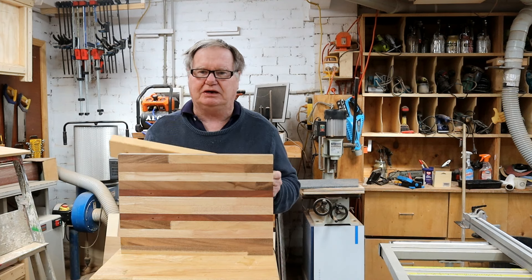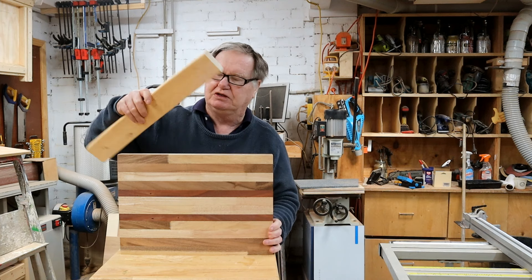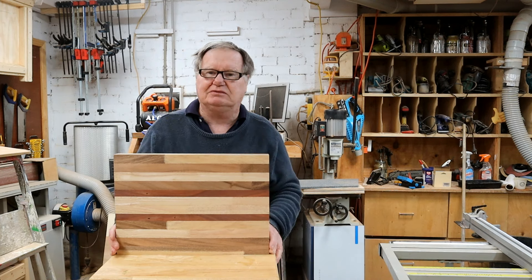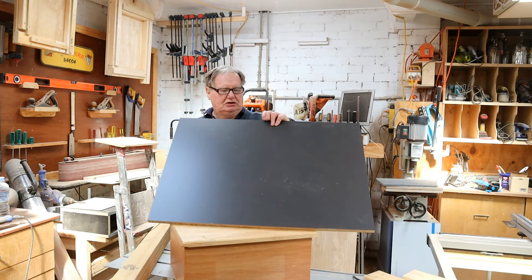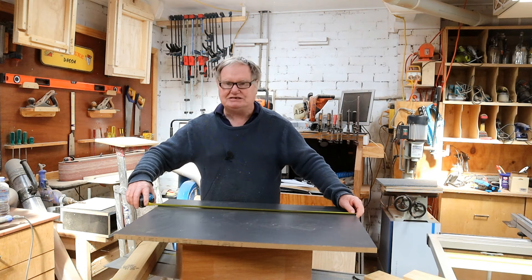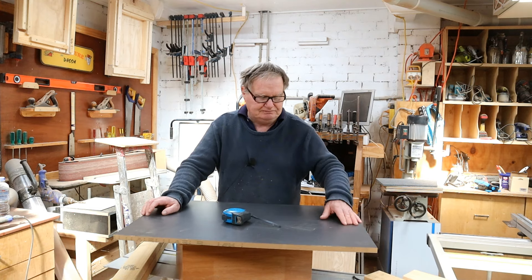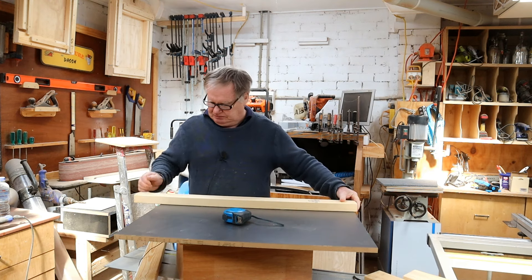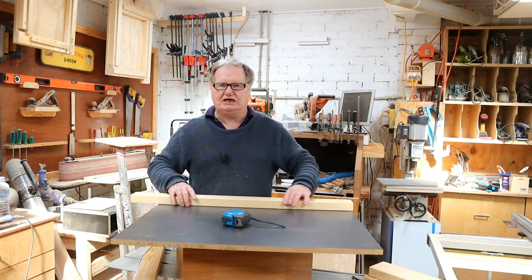So all we have to do is make sure that's the same thickness as 35mm - that's another trick of the trade. Now the next step is to make our swing jig. It takes a bit to make, but once you've made it, you've got it - just another jig in your arsenal. I'm going to explain how I make this jig step by step. I'll start with the baseboard - mine is made out of 16mm MDF, 770 by 550mm. That's a good size for cutting boards - it can do small cutting boards and also large cutting boards with the arc. The next step is to cut two pieces of pine, 70 by 35mm, 770mm long - the same length as the jig.